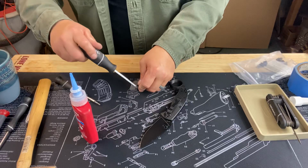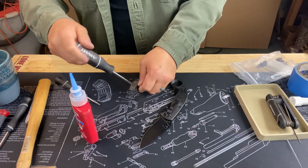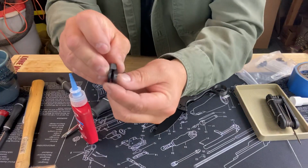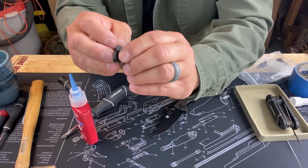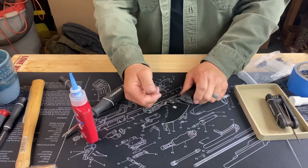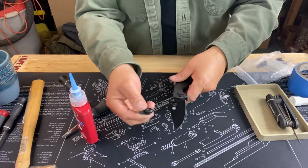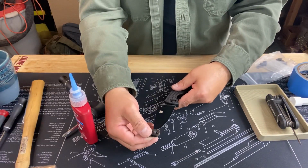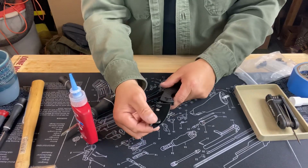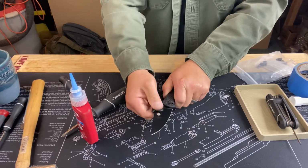Careful when you're actually putting the Thorn on, so as you don't cut yourself, because you are messing with the blade. All right, so best way to do it, if you'll look on the inside of the Thorn, it's actually thicker in certain places, so you really can't push it over the top. I guess you could, but you take the chance of splitting it and possibly breaking it. A best way to do it is to slide it onto the blade. So you're going to take the point of the blade and you're going to stick it right there towards the top edge, obviously with the hook going forward, and then you're going to slide this thing back. Bring it all the way back, and then it gets into position.